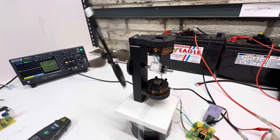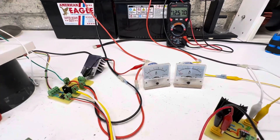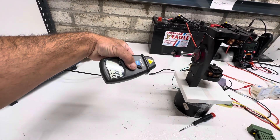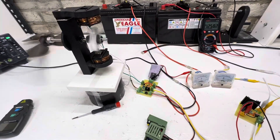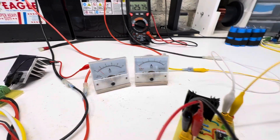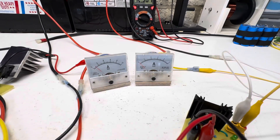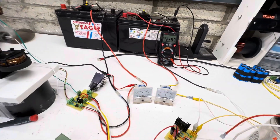We're going to start turning this up. It's about 1 amp right here. Let's see what the RPM is — 1,290 RPM at 1 amp. And we can see the cap dump dumping, going up to almost 21 volts. So we're returning about 4 amps at 20 volts to the second battery.